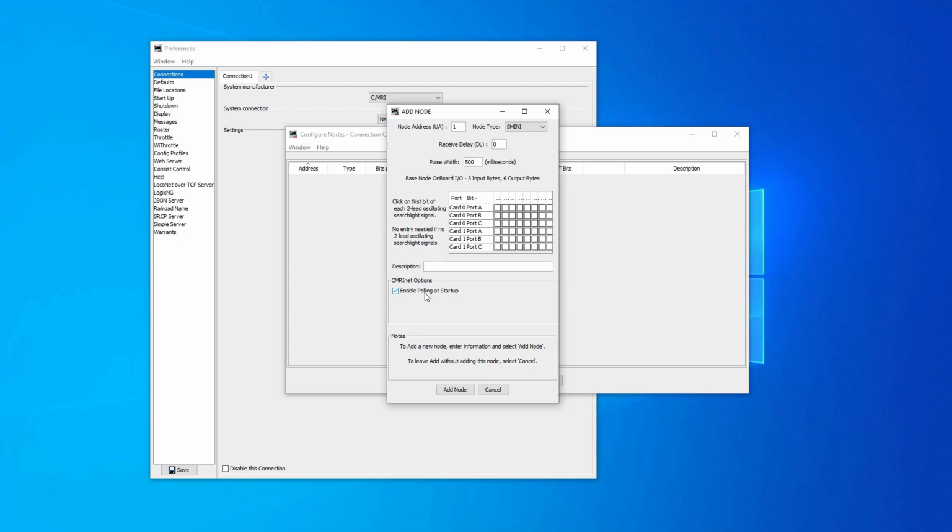And that's a throwback to RS-485. That's the way RS-485 had to work. It's only a few bytes. It really is only a few bytes, so it's not that wasteful. So if I was to say, well, actually, I don't want polling anymore, I can manage the state of the sensors on the Arduino, then there's more code involved. So I'm going to stick with this polling approach, because that's the minimal code approach, and that's kind of the benefit, really, of using CMRI on TCP/IP over using MQTT. So I'm going to stick with that.